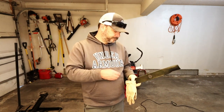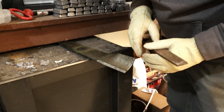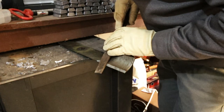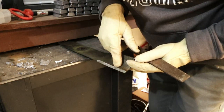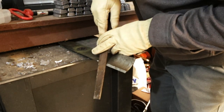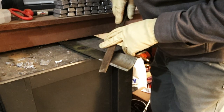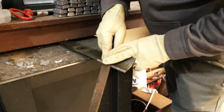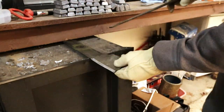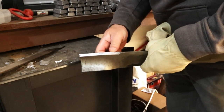Let me show you how to sharpen these. If you keep up on your blades, all you're going to need is a file. If you wait too long, you'll actually have to take a grinder to it, which is not recommended — you'll heat your blade up. So if you keep up on them, it's a lot easier to just go with a file. Keep your file at the exact same angle as this edge. Now that's plenty sharp enough — not hair-popping sharp, but pretty sharp.